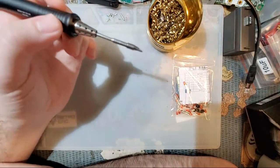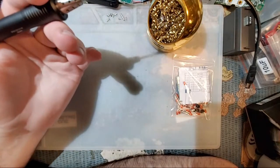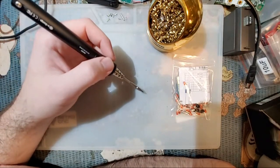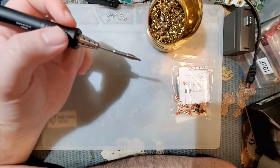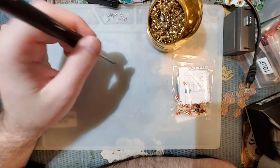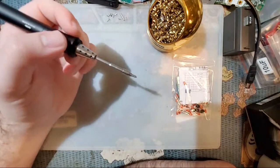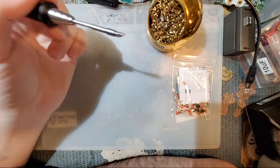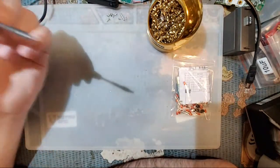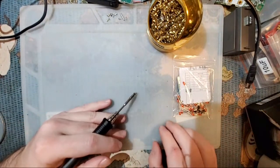I think. A lot of people recommend to newbies just getting started soldering, oh, just take an old PCB from something that's broken, try soldering that, try desoldering components from that and soldering again. But if you're buying something made after like 2005 thereabouts, it's going to be with lead-free solder, which melts at a much higher temperature and is much more difficult to work with. So it's not the same at all if you're practicing on lead-free and then going to the leaded stuff. I highly recommend just starting with the leaded stuff and going from there because that's all you're going to be working with.